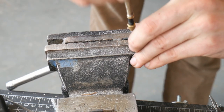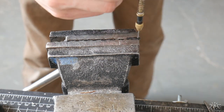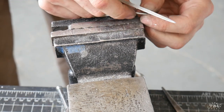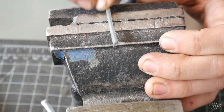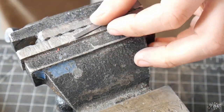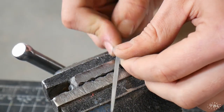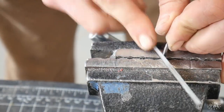Once again using the pin drill - I think it's a 0.8 millimeter drill bit, which basically just snaps instantly if I try to use it in my electric drill. Now I'm filing the tip of the screwdriver to make a Phillips head, cutting four grooves to create a cross shape. This next piece I'm making out of mild steel - this is going to be a saw blade. There we go, the three pieces for this Swiss army knife all roughed in.